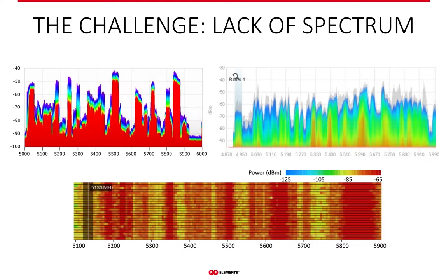The number one challenge WISPs are facing is that of the RF noise in the unlicensed spectra. WISPs commonly see spectrographs with high to very high noise floors that prevent wireless networks from optimal functioning, all the way to the point of almost giving up on the unlicensed spectrum — and even the WISP business altogether.